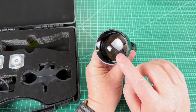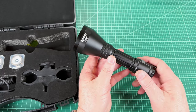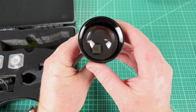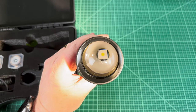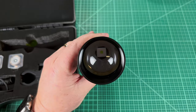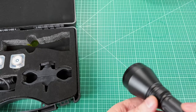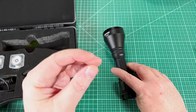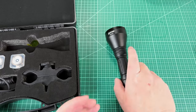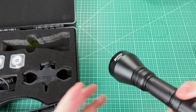Let's take a look at the front. It's got a large aspheric lens instead of a reflector, so this is basically what we call affectionately a zoomie. One of the things that makes it so good is the white LED emitter in the bottom there has a perfectly round phosphor surface. That gives this zoomie an advantage other zoomies often don't have: when you zoom in tightly, you focus on the phosphor surface, and instead of the beam being square, it's actually round. So this is a round-beamed flood and thrower throughout the whole range.